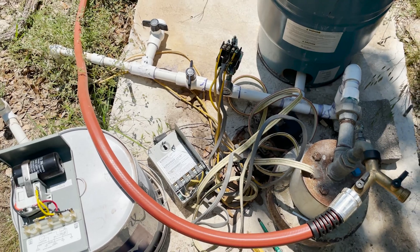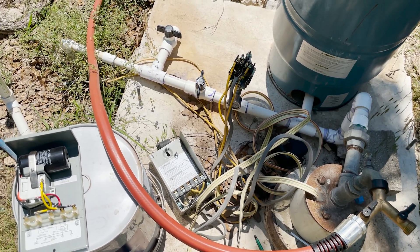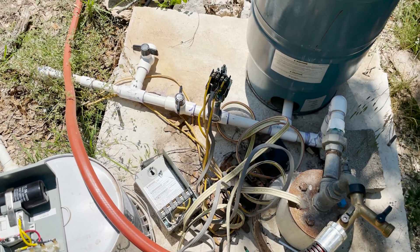I've got lots of questions about this whole setup. If you've seen any of the other videos or pictures of this well, you'll know that it's not exactly the most professional-looking job. My concern is that the pump I have might be a one-and-a-half horsepower pump, and the control box I got is a one horsepower control box. So that may be causing some of my problems.